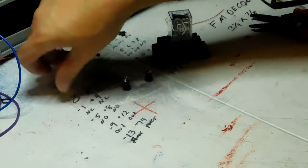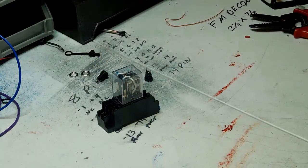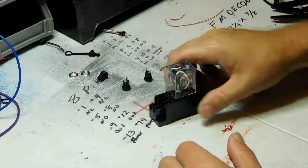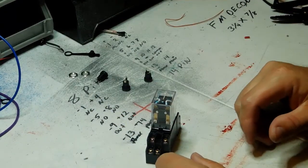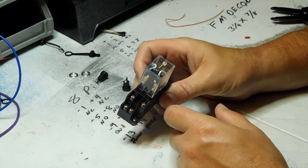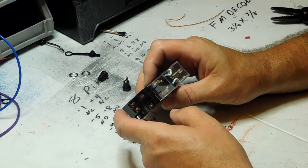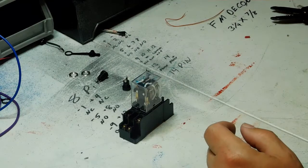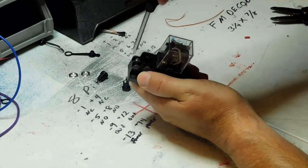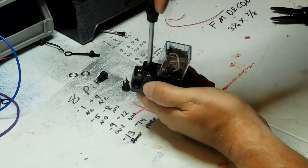The relay has several sets of pins. You have pins one and four, which are called normally closed - meaning if the relay is off, these terminals always come through with no interruption. You want the battery on the normally closed side, which is pins one and four. Let me put the wires on the relay. Go ahead and get a screwdriver and loosen up all the screws - you're going to use all eight screws - so we can put wires underneath them.